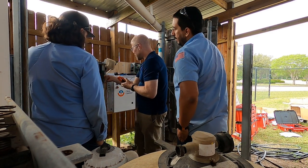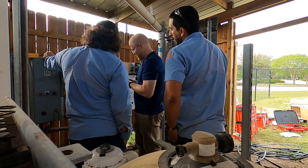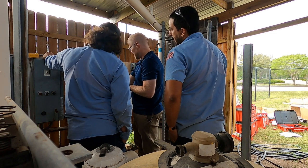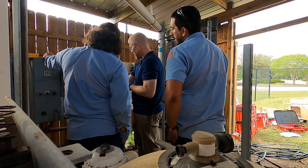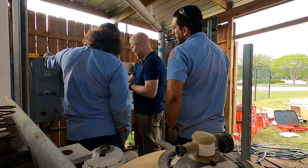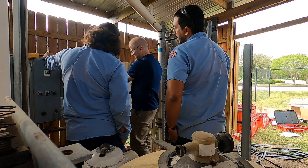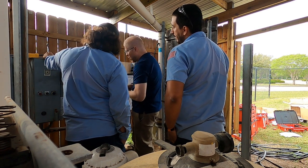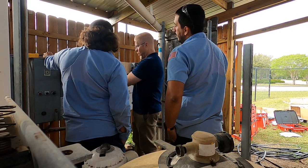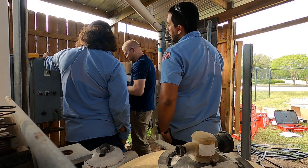We're going to check line 1 to line 2 voltage. Line 1 to line 3, line 2 to line 3. So I have no voltage between the lines. But that doesn't mean there's no voltage. It means that they're all the same, or one of them is open and the other has voltage, right? If there's nowhere for it to go.